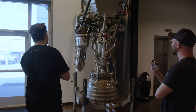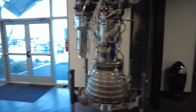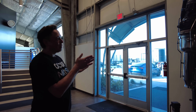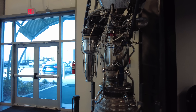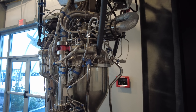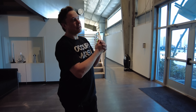Anyway, this is maybe a bit too much history of the Merlin 1C, since this was kind of a blip in time. We moved on to the 1D, which was higher thrust, more efficiency, and easier to build. But it certainly gives you a sense for how much simpler this engine is than Raptor — that's mostly what I was getting at. Just having a single-shaft turbo pump, only one turbine, and having the inducer and impeller be a single piece is just dramatically simpler than Raptor.